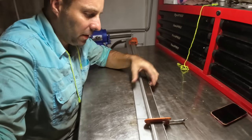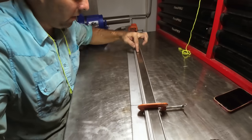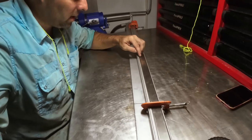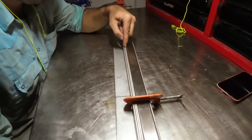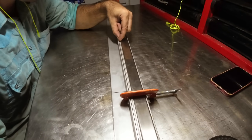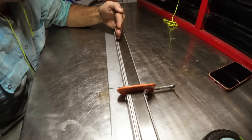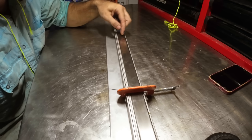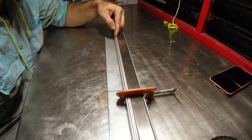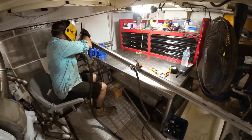It's amazing, eh? So this has been flipped over. This is the piece that Jess just tacked together on the back here. I've got my 25mm box section that's going to eventually become the door. I've got the piece that I need to weld on this side, but I've put two extra pieces in here as a spacer, so I've got a 6mm spacer. And the reason I've done that is because we've got a couple of mil of mesh plus a pop rivet, so it's probably going to be another couple of mil of pop rivet. So by the time we get this box plus the mesh and the pop rivet, we might only have a mil or two of clearance coming along here.